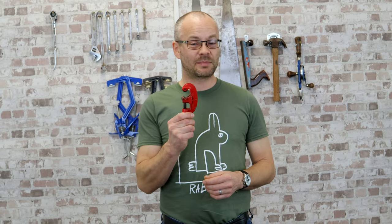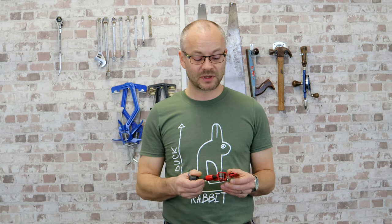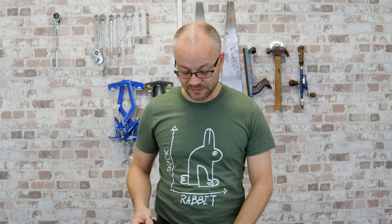The second tool I'm going to show you — believe it or not — is a pipe cutter that plumbers use. These are great because they're very versatile; you can put different sized cables in because they're adjustable. The blades are very easy to replace and it's deep enough that it will cut through the armour. The blade on this I've had on there for maybe 10 or 12 years, so it's doing really well. I've definitely got my money's worth out of this.